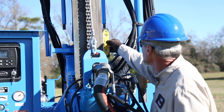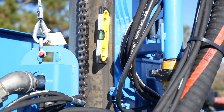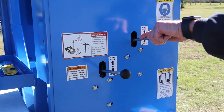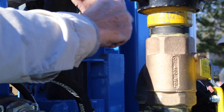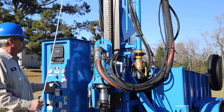Check and level the machine. Next, extend the mast tower. Using the winch lever, lower the winch cable approximately 10 feet, maintaining tension as the cable slackens. Rotate the L-shaped tower lift supports 90 degrees outward on both sides of the rotary drill head.